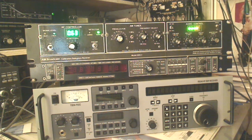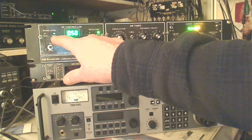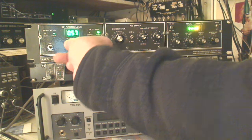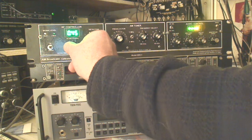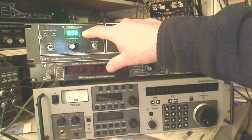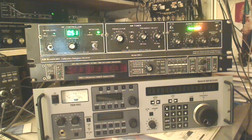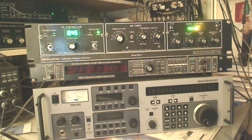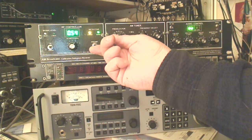You can see we're over 50 microvolts on this station. If I detune it with the attenuator, you can see that it flops over to the less than 50 microvolts. We get an actual reading here for reference purposes. Right now the carrier is jumping around with the positive audio modulation, so you can see we're in the 40s and up to the 50s, even 60 at times. We can invoke a preamp which will add 10 dB to the system.